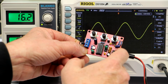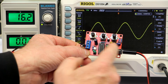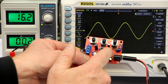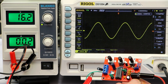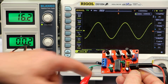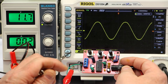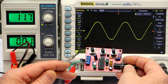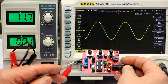You might already see there has been a lot of resoldering going on here on the little PCB. We'll go through it point by point — I'll first show you the results on the oscilloscope and then show you a revised schematic with the fixed issues, or what you have to do on the PCB and schematic to fix the problems yourself. The first annoying thing was that the output signal is DC coupled.